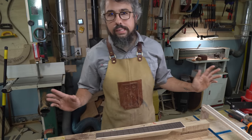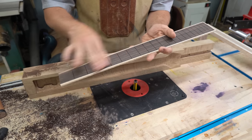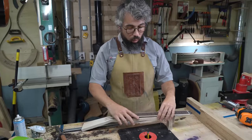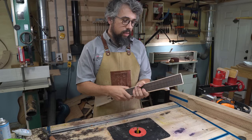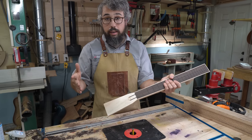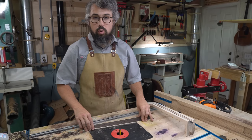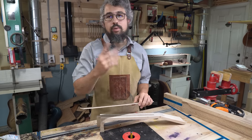I did it off camera — I just decided you didn't need to see it because sanding is sanding. We've got this thing absolutely perfect now, no sort of ridges on it at all. It just looks super good, and at this point it's time to glue this thing onto the neck. I did want to address people who might ask why you don't radius it once you glue it to the neck. Problem is that the neck is going to have either a back bow or a forward bow, and that's not going to allow you to get this thing perfectly smoothed down truly. That's why I think it's better to radius your fretboard while it's glued down to something you know is totally flat — just save yourself some trouble down the road. An ounce of prevention is a pound of cure.